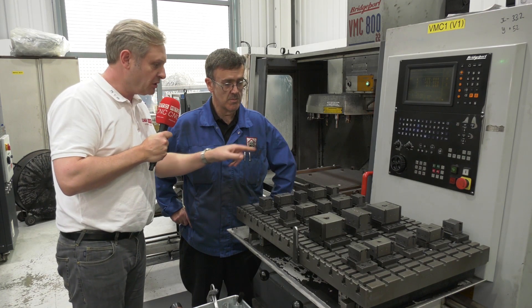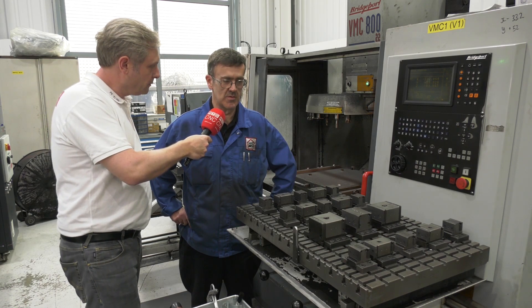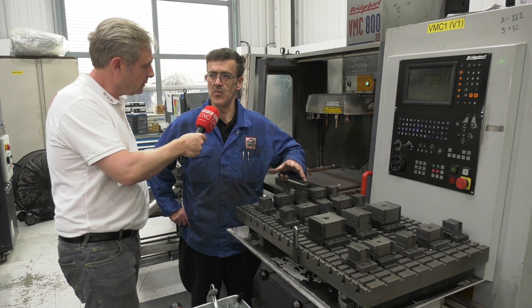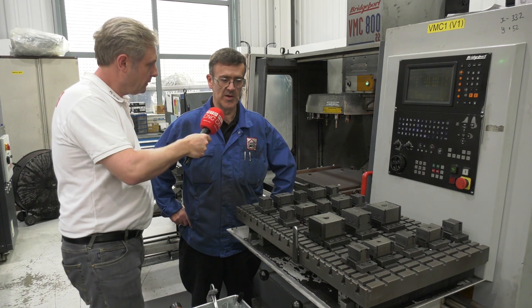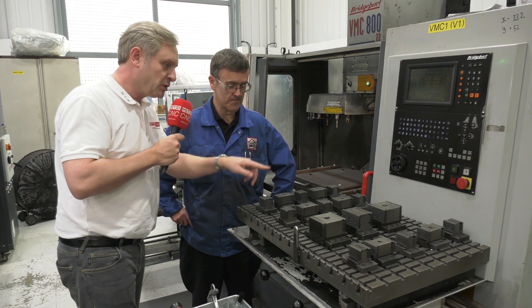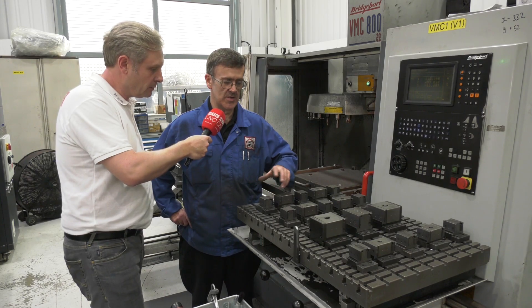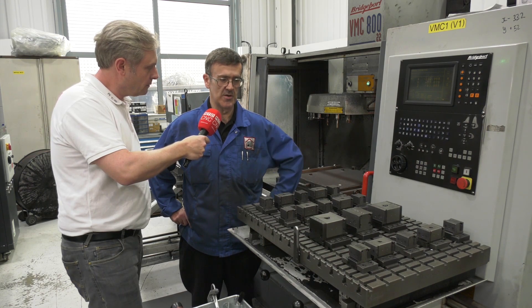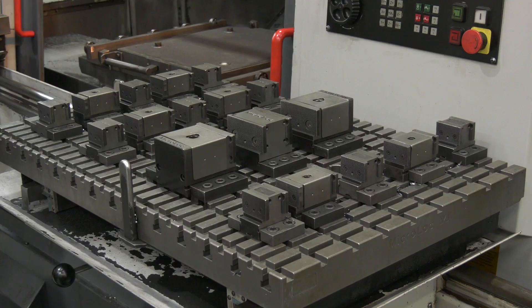And I understand — because you've got 16 jobs going on here? 16 parts, yeah. Sometimes two: you can set one side of the micro lock for one size, the other side for the second off, which is what I do frequently now. And obviously different sizes — what size are these? These are the 50mm vices, but on this side of the vice I'm using 50mm and on that side 30mm. So again, just giving you that flexibility. Yeah, brilliant, absolutely.